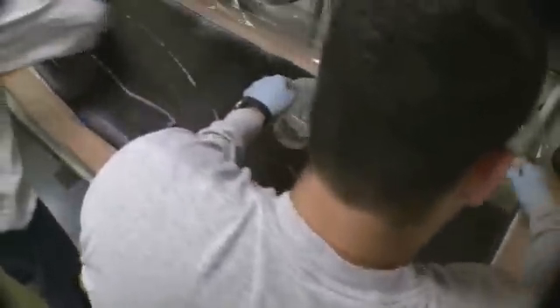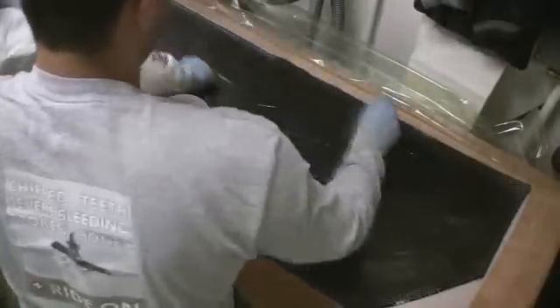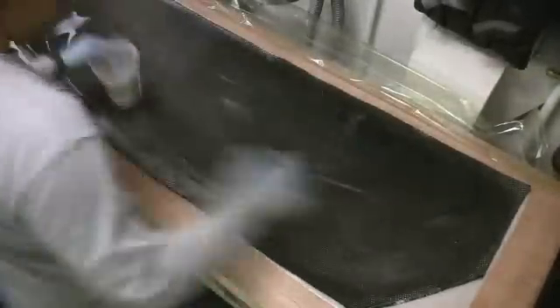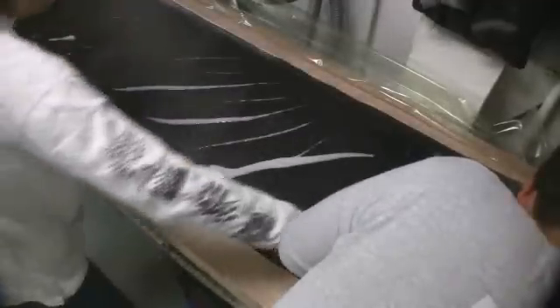What we're doing here is trying to work out the bubbles. When you first lay this down, obviously the sheet has all the space between the fibers filled with air. Whatever this sheet comes out looking like, that's what your bottom will be — the goal of this board is to not have to finish the bottom. It should look beautiful without sanding or clear coating.